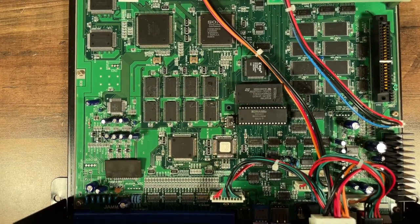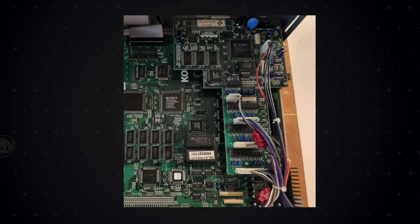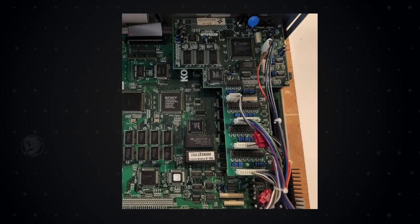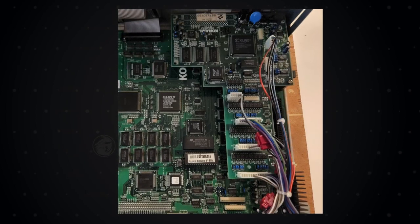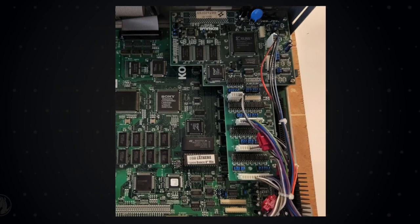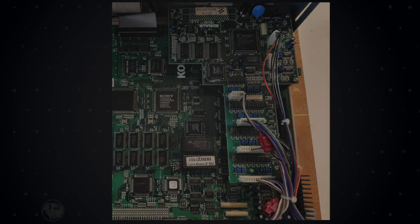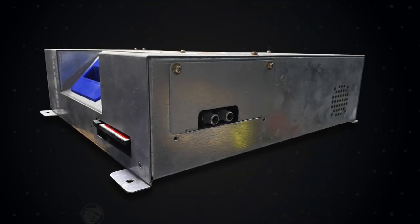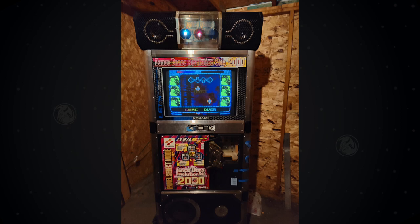Games using the analog IO board use the audio output port of the CD drive directly. The other type is the digital IO board, which contains an FPGA device acting as a decryption device, feeding decrypted MP3 audio into an MP3 decoder, the output of which is fed into the same audio input on the 573 motherboard where the CD drive would normally connect. It also has a pair of RCA jacks at the back for networking to other units via asynchronous serial connection in a ring topology, used by the DDR Solo spin-off series to link up to four machines together for competitive play.